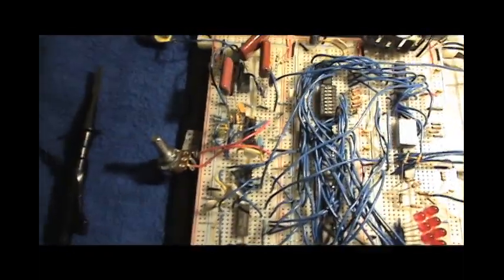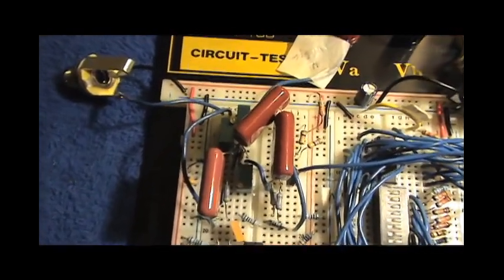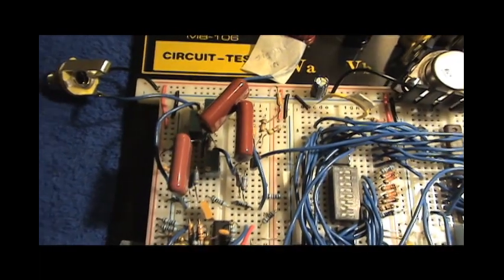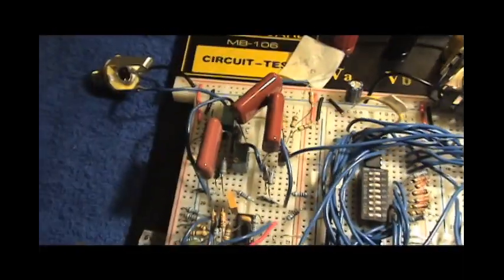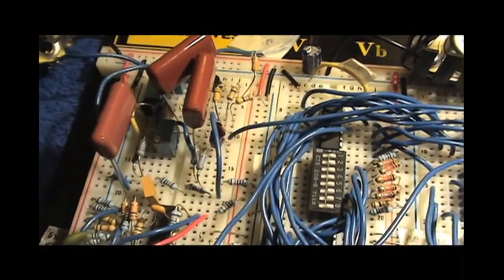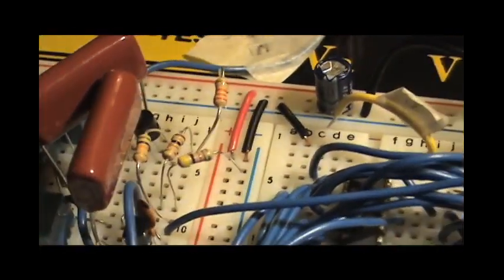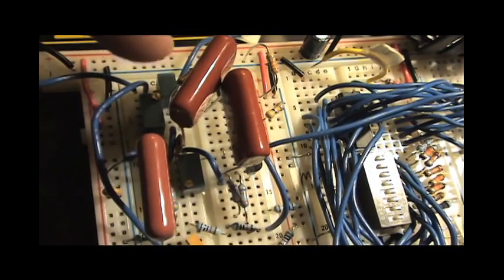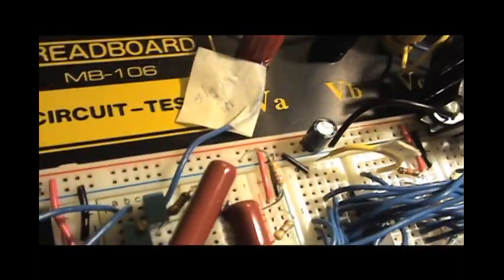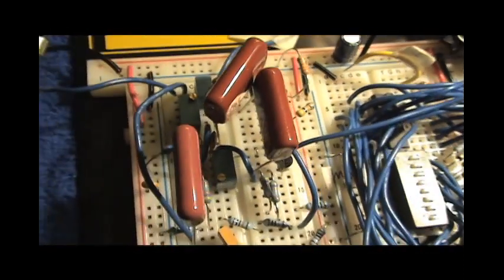So let's just explain a bit of what is going on in the circuit, and then we'll try it out. This section that's shown in the camera here, this is the frequency doubler circuit, and this is based on a circuit that I found on a website, which perhaps I'll put in the description, and it's based on three NPN transistors, and I'm using these large capacitors because this is all I had with the correct values. But you see, these are both 1 microfarad, so eventually I'll be using all small rectangular components like that.